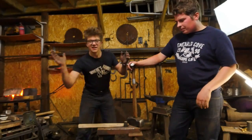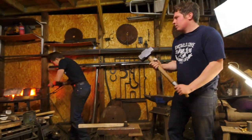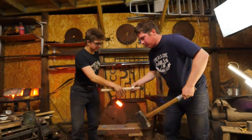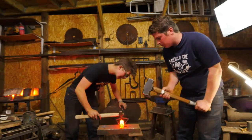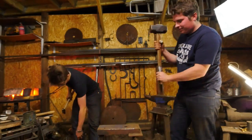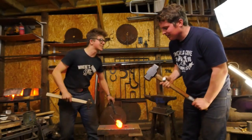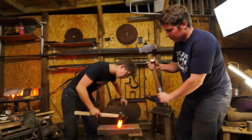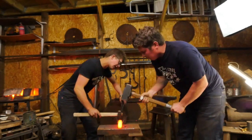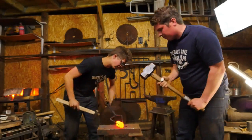Brilliant. Let's do some more forging. The piece of steel is going to be hot. Let's punch a hole. Pop a plug out of this thing. And now we'll go ahead and go hard. Don't worry about it. I was actually tilting it to adjust the hole, so that was just the nature of it slapping down. I tilted it a little more to solve the issue a little bit better. There we go. Now I can straighten up. You see, tilting the billet when we want to straighten out the hole.